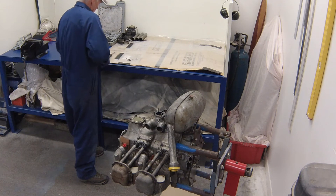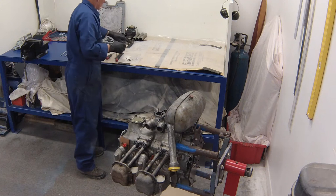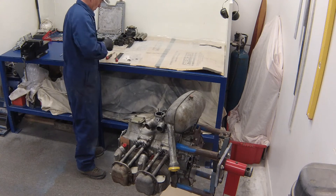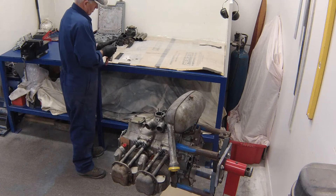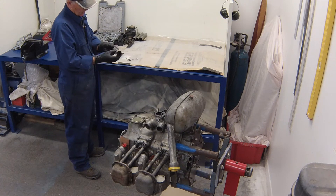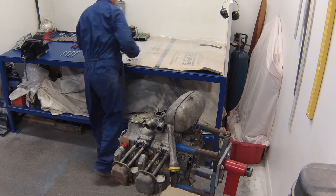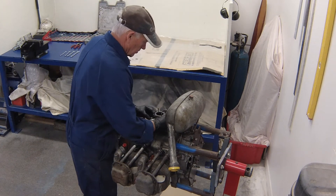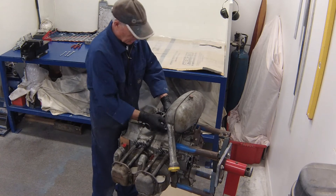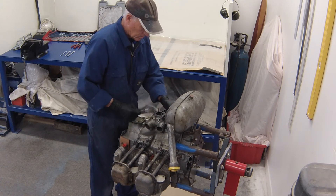Inspect every tube carefully. You're looking for corrosion or any compromise inside the tube. They're quite thin-walled, and if there is a pinhole it will upset the air-fuel mixture by allowing air to be sucked into the manifold tube. This will demonstrate itself by one cylinder always running lean, or the exhaust gas temperature being consistently high due to a lean mixture. Another common issue on these tubes is chafing from cable ties that have been wrapped around the tubes to hold other things in place. Over time, cable ties can fret on the tube and wear through it, especially the more rigid type.